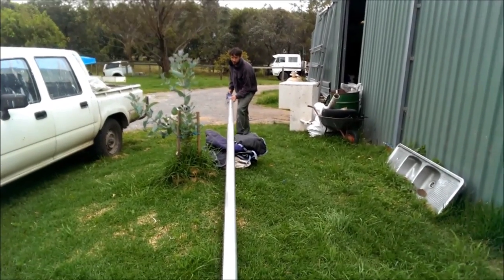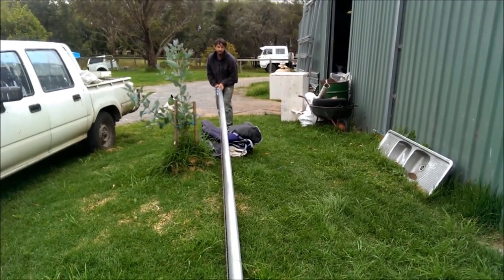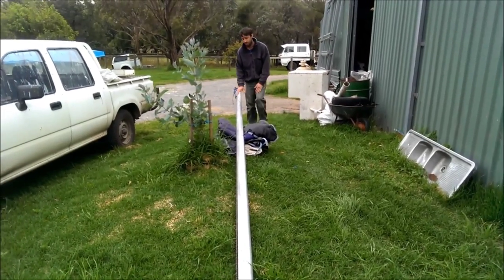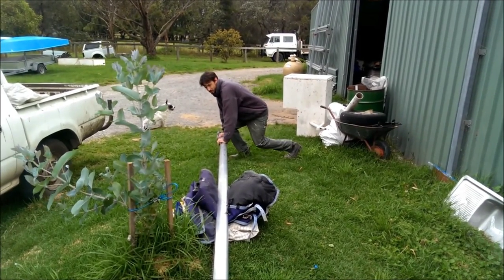As you can see, you'll need an extra person to stand on the mast. What you're going to do is position the padding, or the pivot point. For this bend, I'm going to have it just pretty much on the hound, or just below the hound, and apply gentle even pressure.